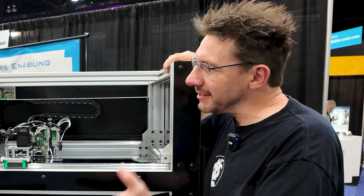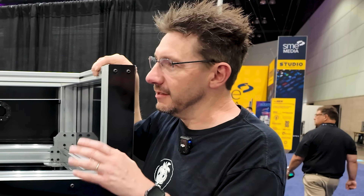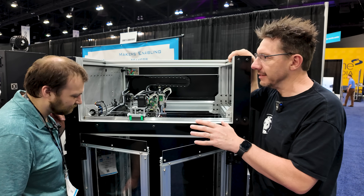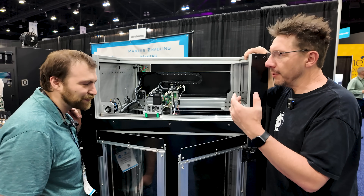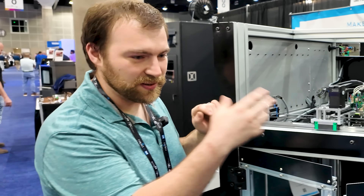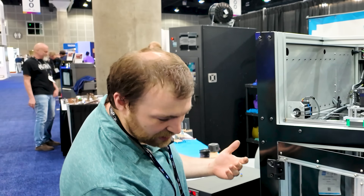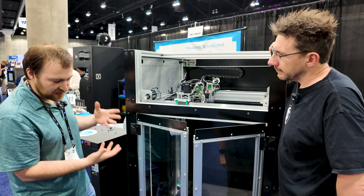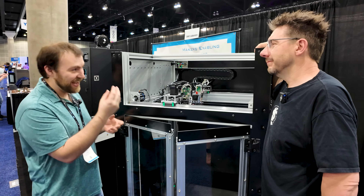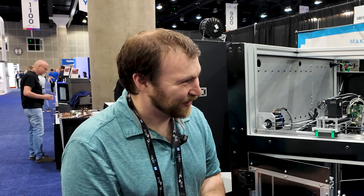This fantastic machine should have been moving like crazy and spitting out plastic like you wouldn't believe, but there were issues with shipping. This uses Quad Z with hung lead screws, because you're always supposed to use lead screws in tension. The motors are on the bottom, supported by standoffs. These standoffs are not intended to be structural — they're just intended to prevent the motors from rotating. In shipping, they became structural.